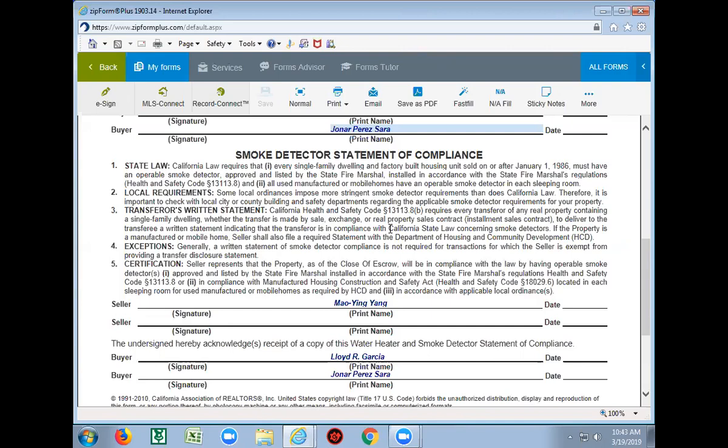And that's why the carbon monoxide detector, you put in the hallway, will trigger first. If a fire breaks out, there is definitely carbon monoxide as well, or if a gas leak happens, it's in the hallway, but you may not hear it. But so far, the law does not require a carbon monoxide detector inside the bedroom yet. I don't know, who knows when they may. Still, it's the hallway. They don't require installing one inside the bedroom, only a smoke detector in every sleeping bedroom.